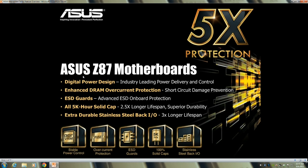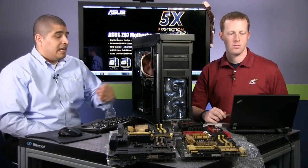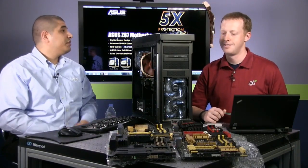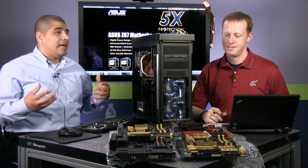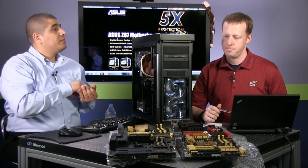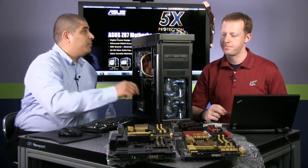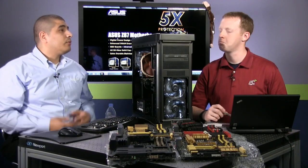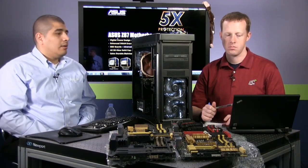we actually use stainless steel for the actual metallurgy, and then we have a special coating that we put on them. It minimizes the oxidization that even occurs to the housing assembly, because what we've noticed is in different environments that have different ambience, the inside can become oxidized and it can sometimes affect the inside contacts. So things like USB ports can sometimes act a little bit wonky over a long period of time if you're in a really hot or ambient environment.